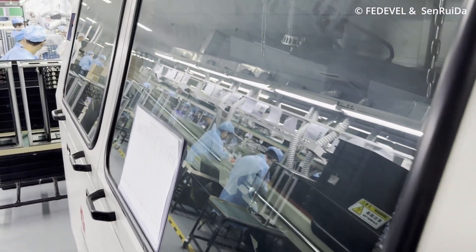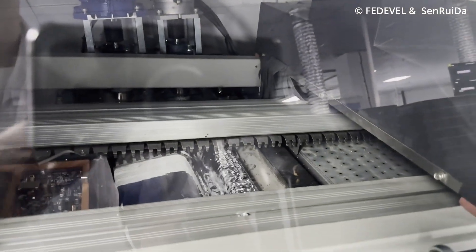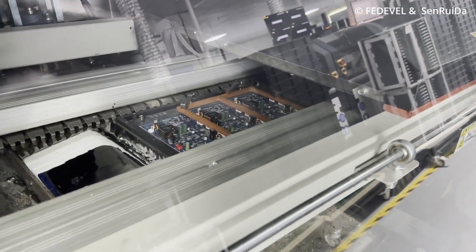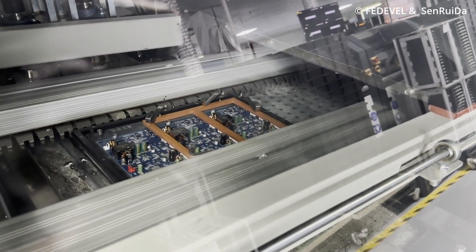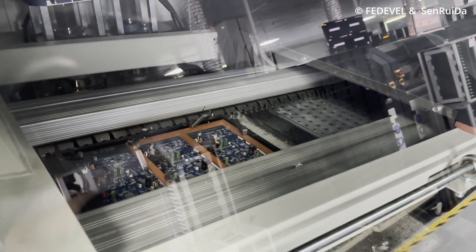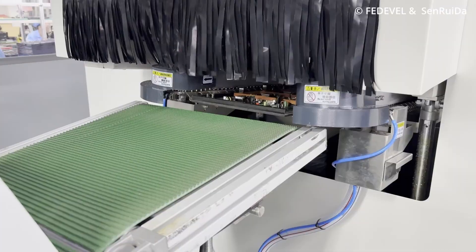This is a very, very cool machine — I always like to watch the wave, it looks very nice. This is the melted tin, or melted solder, and the boards just go above the wave. Notice that all the boards are placed in a frame, which is very interesting because there is something special about the frame. Also notice that sometimes they have to place weights on some components so they are not lifted up by the wave during soldering.